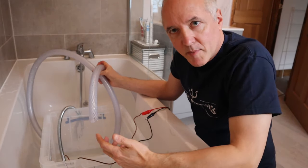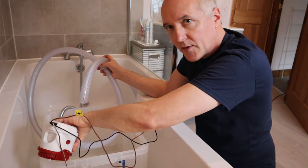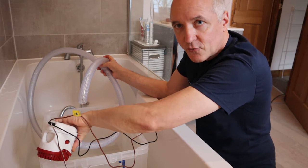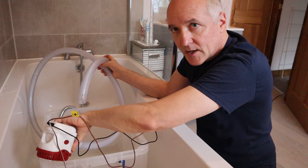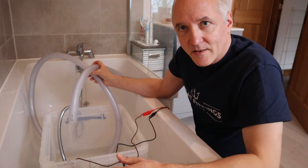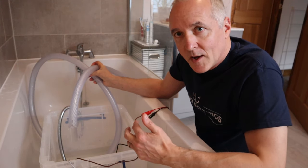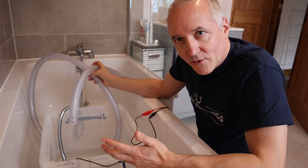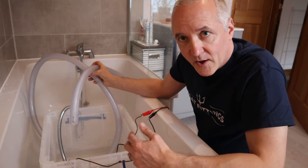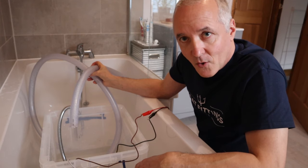This time we're looking at the other kind of bilge pump. In this case it's a slightly smaller unit and it looks very similar, but it works in a different way. It doesn't have a moving float switch inside. What it does is use electronics to detect if there's water that needs pumping out. The way it does this is every two and a half minutes it will turn the pump on, and if there's water in there, it detects it by the amount of electrical current it draws. If there's no water, there's a small current and it turns off. If there's water, it carries on pumping until the water's gone.